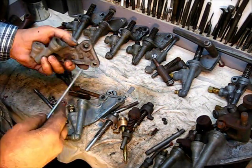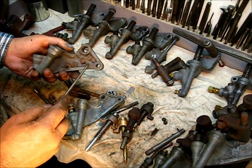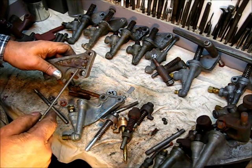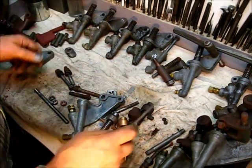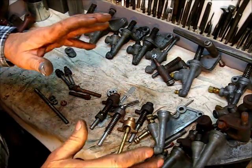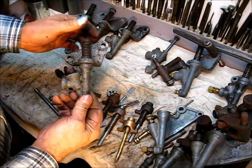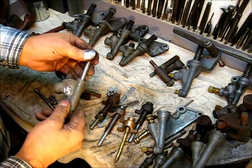At some point they put a strap on there, and then they tried to weld it, which was not successful — it broke again right beside the weld. That's usually the case with this pot metal. You can tell because they ground a notch in the weld and put the strap on there for further use, and then it broke again. So it's scrap metal. There's one where the bottom's broke off — you can see the check ball right in the bottom. I will salvage the plunger out of that one.